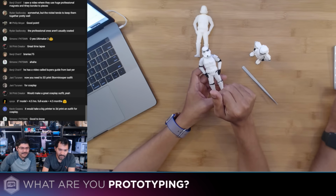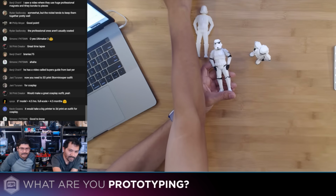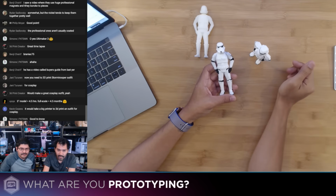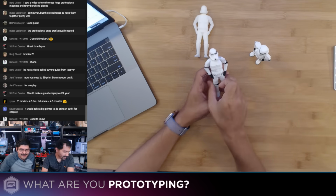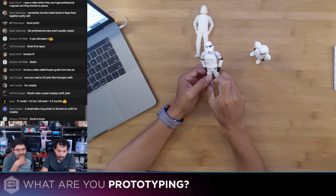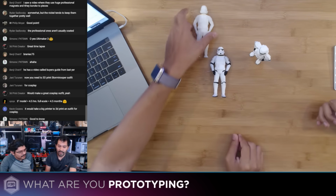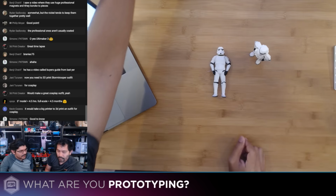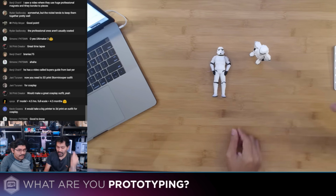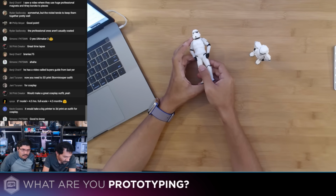Yeah, so I downloaded the custom Cura program that they offer with their profile on there, and it came out a little oozy. A little hairy? Yeah, a little hairy. A little contaminated? Let's watch that again. So this is using the default Cura profile and the filament that came with the printer. Does BCN3D offer their own version of Cura? Yes, it's a customized version of it, and their profile is already set inside there. We're also using a 2.85 millimeter filament.